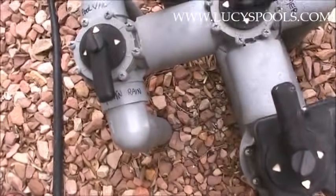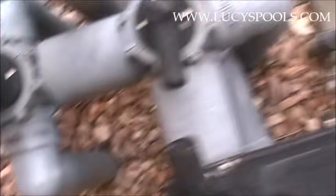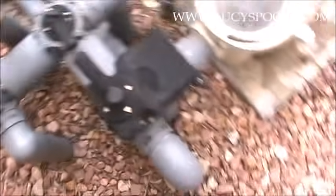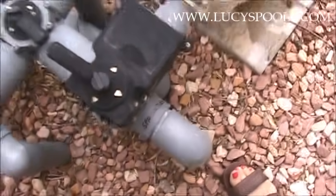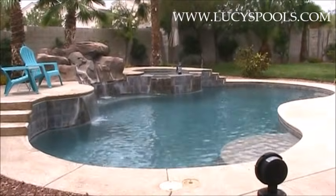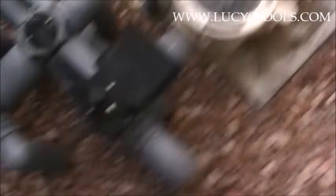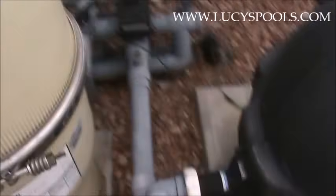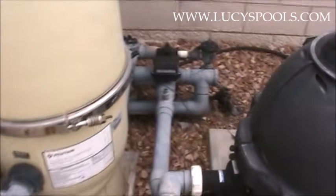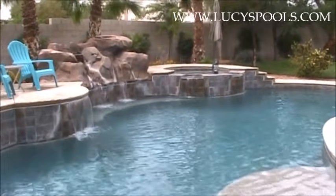For the pool vac, you'd have to feel the side of it. Right now I'm going to leave it half and half — pulling from the skimmer and from the main drain. Nothing from the spa right now, because if we were pulling from the spa and it's an elevated spa, it would drain it. So make sure on the suction side the spa valve is always closed. That's about it for this pool — it's a little complicated, but this is real-world stuff. We'll go on — I'm going to do a couple more of these. See you soon.